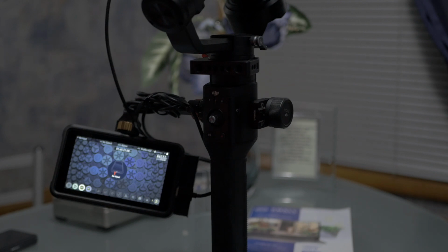as expected, but soon after having this set up for some time, maybe a few minutes, and it's exacerbated by when I start recording, we lose focus control, and we also lose the ability to start and stop recording from the Ronin-S to the GH5S. This is a big problem. Once you lose this focus, in order to gain focus back, you either have to power cycle the camera or power cycle the Ronin.